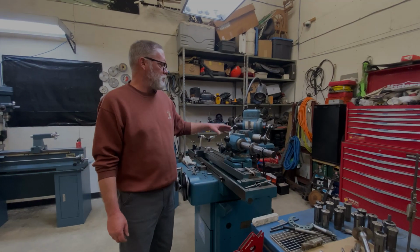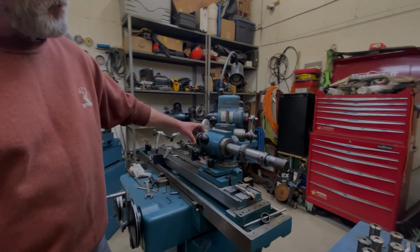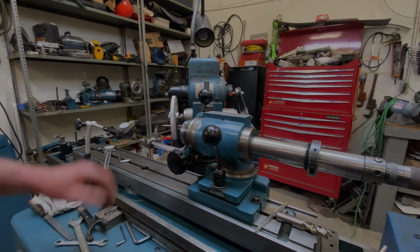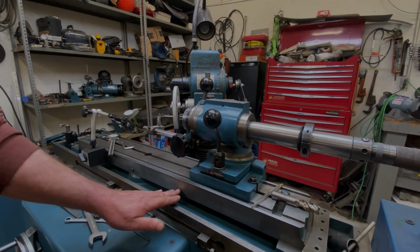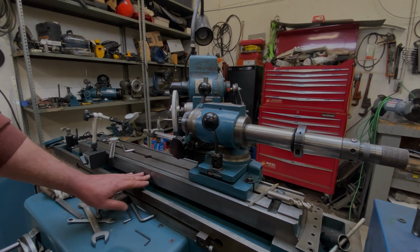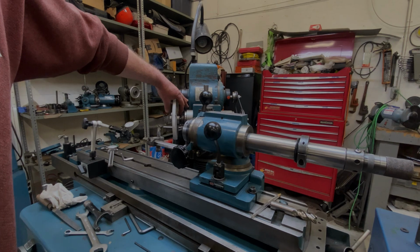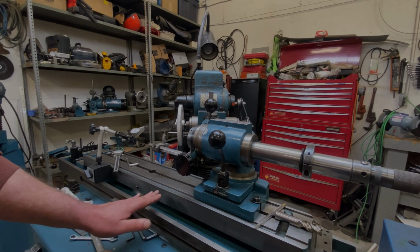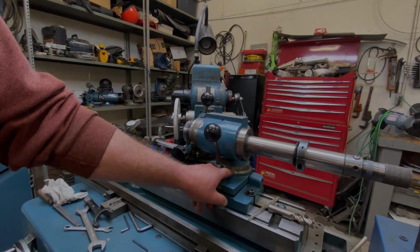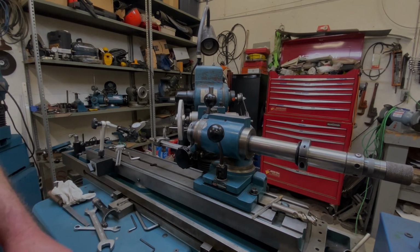I've got my air bearing up here. Don't actually use air with it, but I've freshly oiled it so it's running nice and smooth. First thing I want to do is get this table running true axially. I had this offset to grind a taper on this new arbor that we just finished making, and so I want this to run zero so that the graduations on all my fixtures, the zeros are accurate.